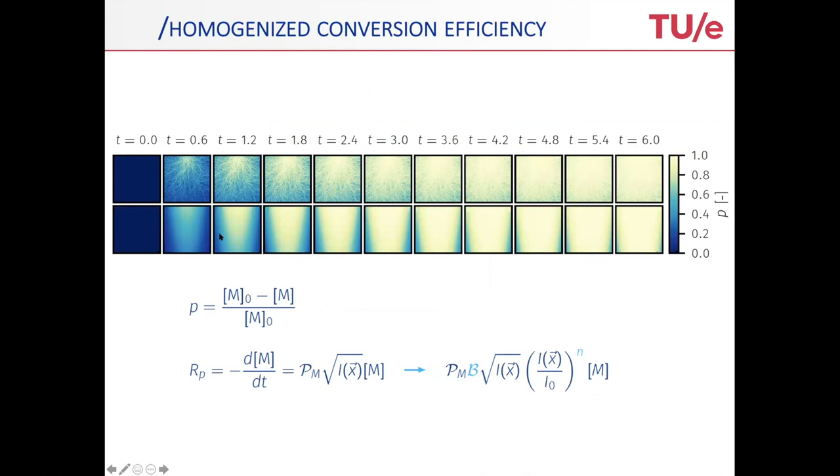Once you've done that, you have a smooth profile that replaces the scattered profile. Now you can do the same for the conversion degree, which picks up the amount of curing. But as we've seen, looking back at the equation, the equation is nonlinear. If we look at the micro-scale solution of the conversion — in the scattered way — and try to homogenize that, one can easily identify that the relationship between the microscopic conversion rate and the microscopic intensity profile needs to be adapted. Rather than using the micro-scale relation, we extend this to a nonlinear relation between the homogenized profiles, because the homogenized profiles no longer follow the micro-scale relation.